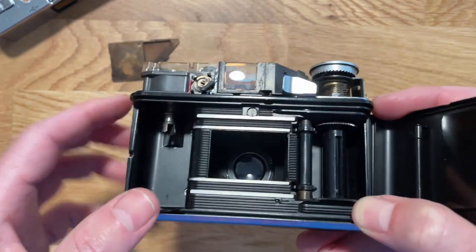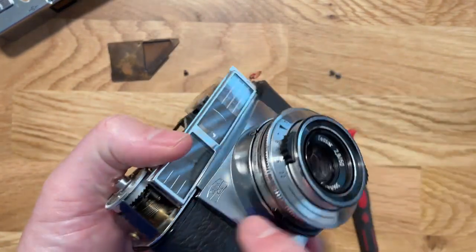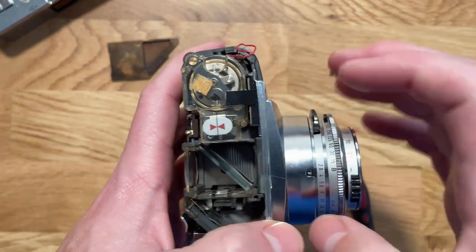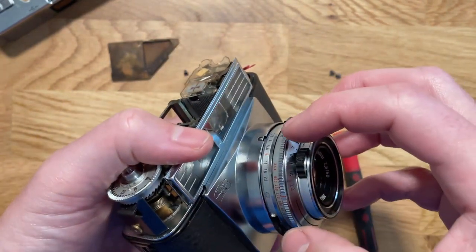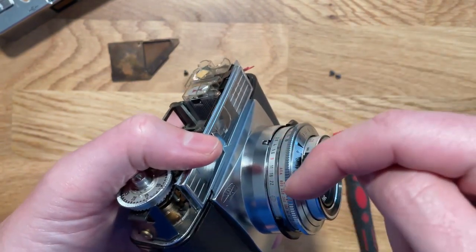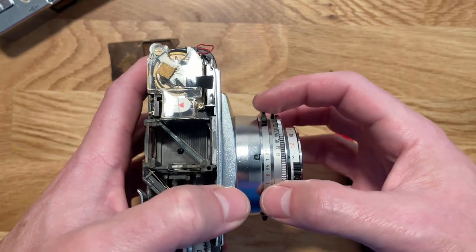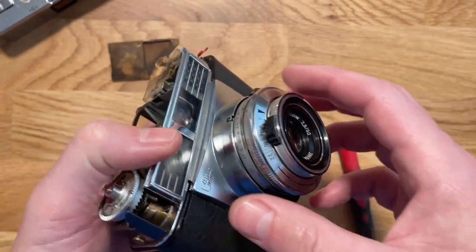These are a little harder to get to, but if you remove those, this whole front housing, which is a chromed metal, it almost looks like plastic, it looks like chrome plastic, but it is a chromed metal around a plastic housing, this whole thing will pull out, and the focal lever, you actually have to push down and unclip it, and you can remove this whole mechanism. It comes out separately, then there's some retaining rings and things like that. You can separate the whole shutter mechanism and lens from the housing, which I've got some video of as well.